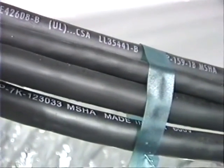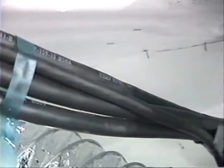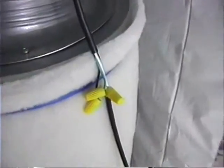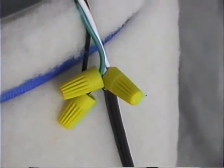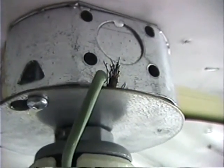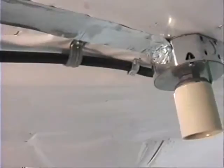Wise growers are cautious and uncompromising when it comes to proper wiring and safe electrical setups. Any metal fixtures, such as reflective hoods, should be properly grounded. Never put a fuse with an amperage rating higher than 15 into a 15-amp circuit. This will start a fire.